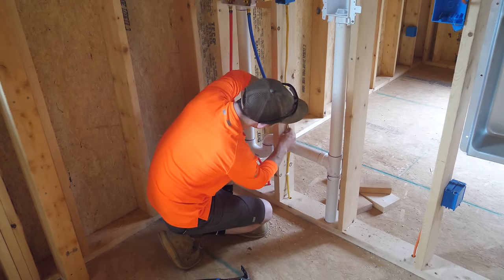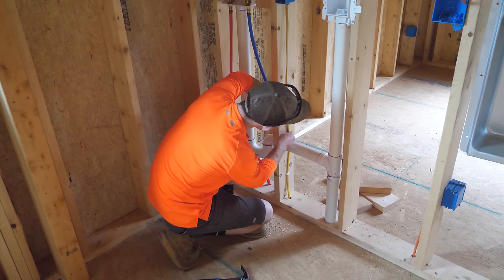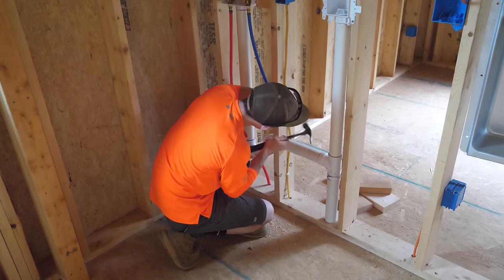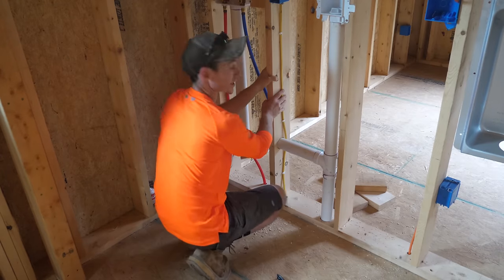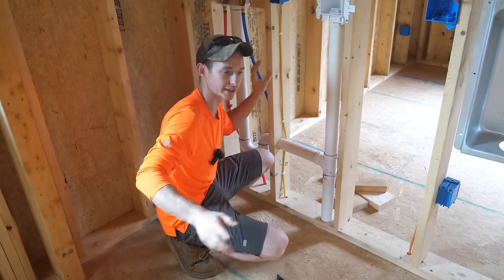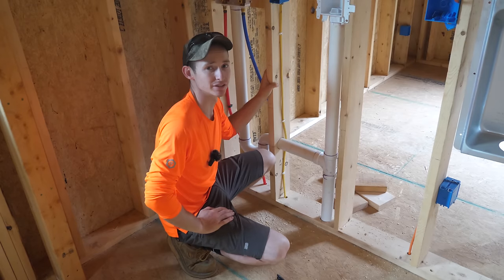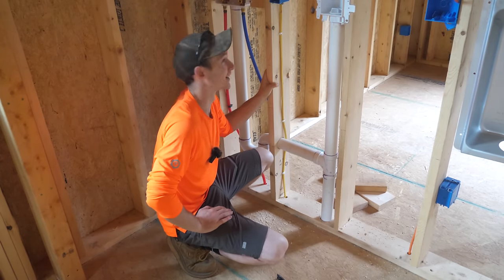This route was a little tight on the required minimum distance from the edge of the stud coming up next to the drain pipe. It did work though, because the pipe was slightly off center. In hindsight, a better route would have been one stud bay to the right, crossing over the drain box and coming into the receptacle from above. We're trying to keep the Romex nice and flat and neat — if you don't uncoil it by rolling it and rather just pull the end of the coil, it tends to twist up and looks really not good. I don't think there are any code issues, but it looks like the mark of a DIYer.